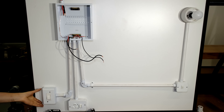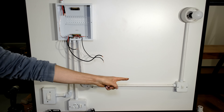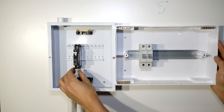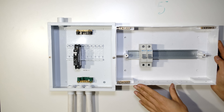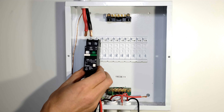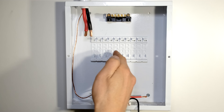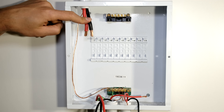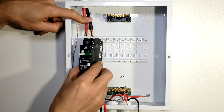Now I have a plug circuit, an oven or stove disconnecting switch, and a light with a light switch, and I'll show you how to wire this up. I'll be using the Samart rail; the circuit breakers look like this. You might also use a DIN rail and follow the same principles. I have a photo showing the finished layout — there is one earth leakage and there'll be three loads, and this entire load setup will be protected via earth leakage. I'm going to use one earth leakage circuit breaker to protect all the circuits that come after it. These are the 16 millimeter supply cables and I connect them to my earth leakage.